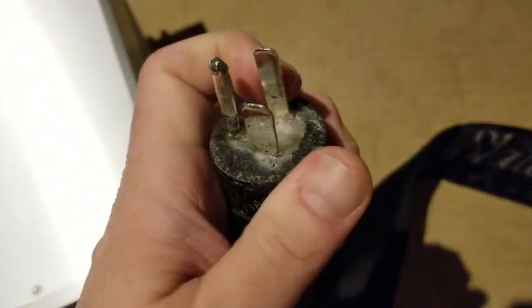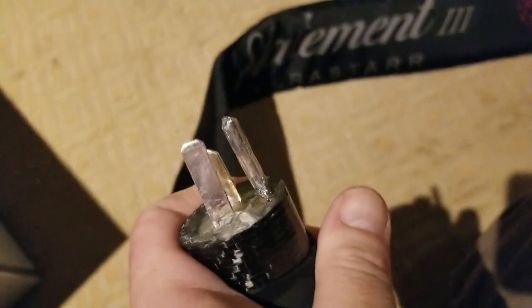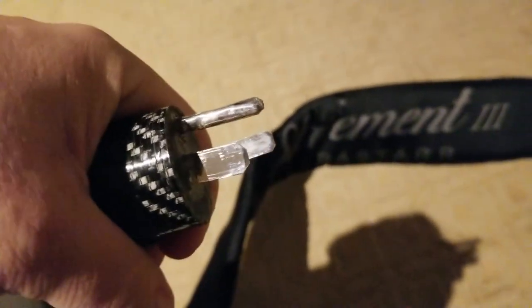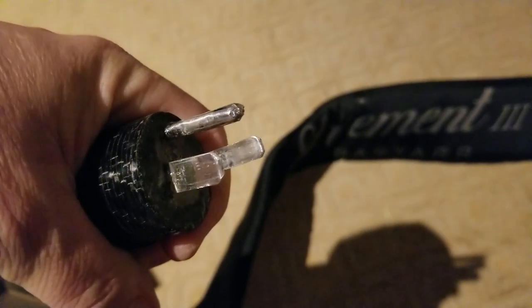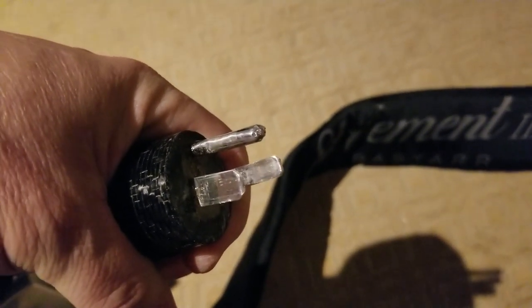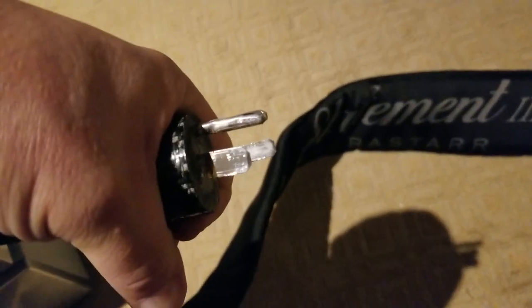I made this 100% out of pure 5-9 silver bar — fabricated completely from scratch. See that wide blade? It utilizes the whole slot. When you plug into those NCF receptacles, you'll see that one of the slots is taller than the other. But the Furutech plugs — the blades aren't as tall. So I made my own out of pure silver, which nobody makes, and made it exactly the proper height so I can max out the surface area.